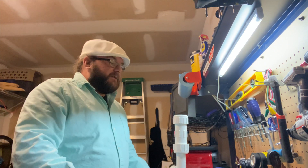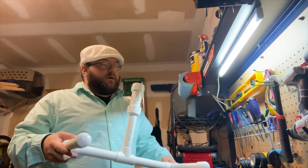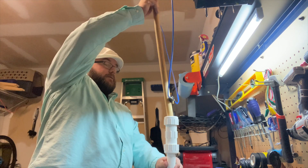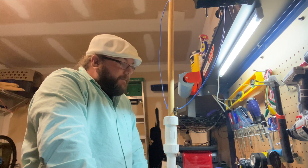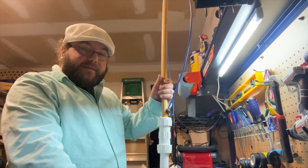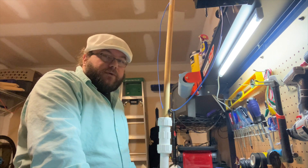That's when I remembered that Larry Plumber W6LVP's website, where you can buy the loop antennas, has manuals — and in that manual he has a description of a little PVC stand you can build for about $20. With just a little bit of time to prepare the materials and very little time to put them together, you can have a very nice stand to mount your loop antenna, or even a small FM three-element beam. A small antenna will fit nicely with a one-inch mast, and there you go — you're DXing.